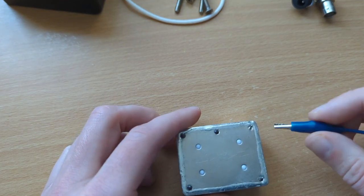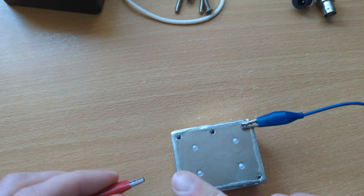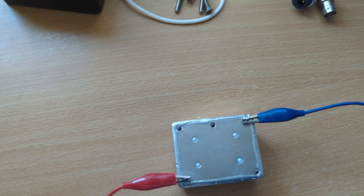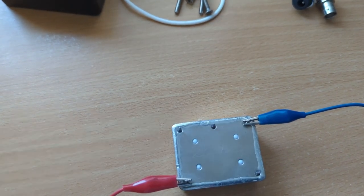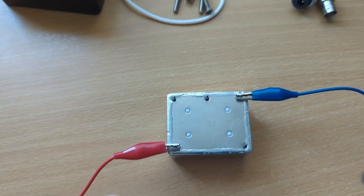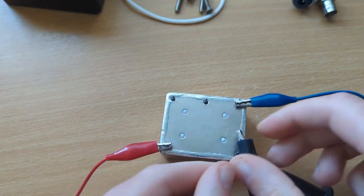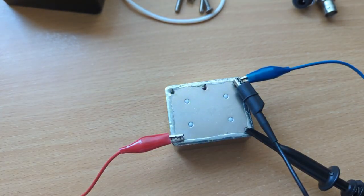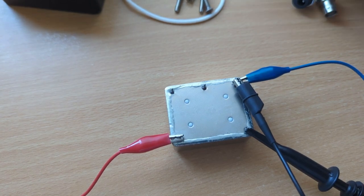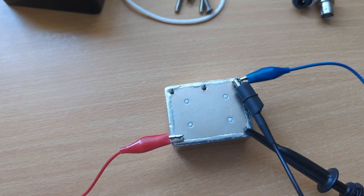If you pull up the data sheet, let's see, pin 1 here is ground, pin 4 is the plus power supply, and if we detangle the oscilloscope probe from all the other random cables I have, it says pin 5 is this one, is the output. So we'll ground the probe like that. And if I connect the battery, you should see 10 megahertz on the oscilloscope.